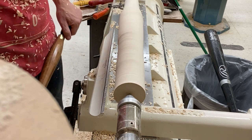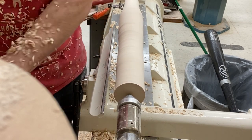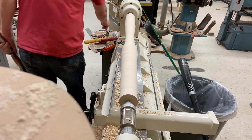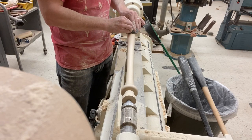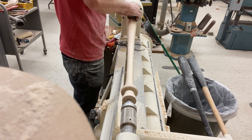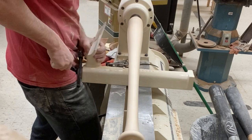This is pretty easy — with one gouge tool I'm able to take a lot of wood off. It's maple so it sticks to my shirt, my ISU art shirt — a lot of the maple sticks to my arm and my shirt. You see here I've found, based on the calipers, the thickness of the end of the handle, and then I'm going to shape the bat accordingly. You see the knob on the end, and now I'm winnowing the handle down. I'm testing the calipers and looking at the Homewood bat for the handle shape and the Rawlings bat for the barrel.